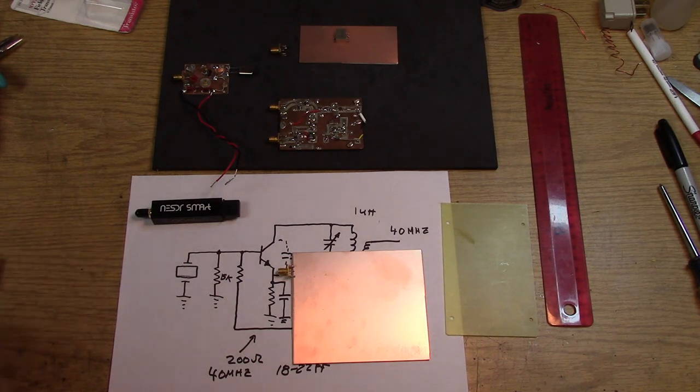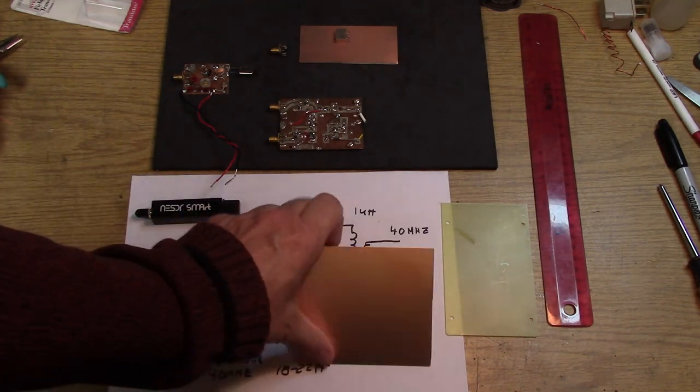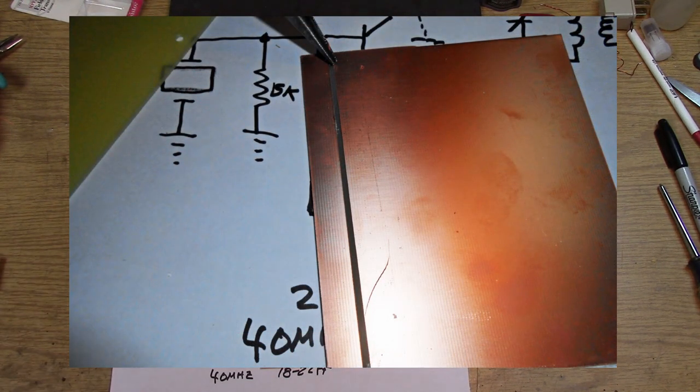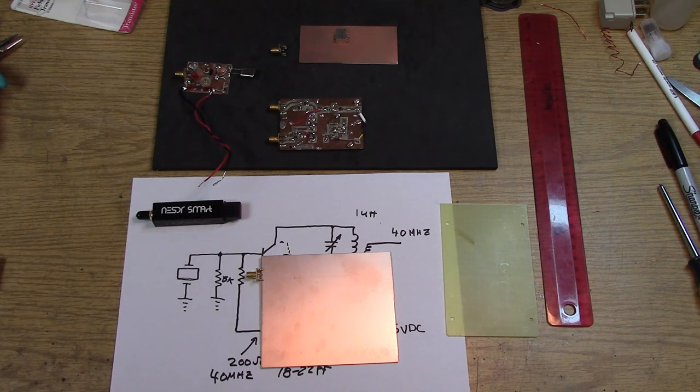So one thing we can do is we can simply consider that we're working on a project that's below 100 megahertz generally, and there's no need to get into counting fractions of dBs and calculating dynamic range and IP3 and noise figure using a complex spreadsheet or some other modeling technique. This is cut and try type electronics here at Microwave One. And for instance, we have some circuit board here that's just a very simple FR4 062, and you could go crazy trying to calculate 50 ohm lines, and you know, rule of thumb, it doesn't matter.